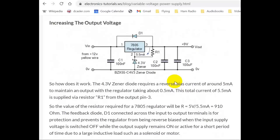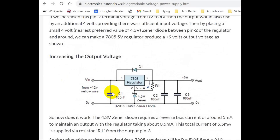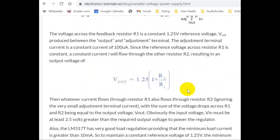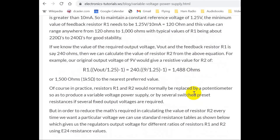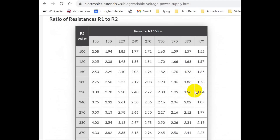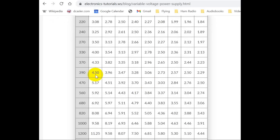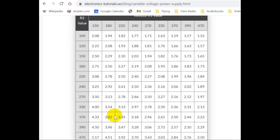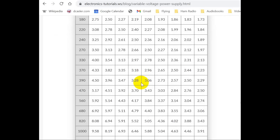Based on some earlier discussions about capacitors, I added capacitors to mine. And then you have this simple formula that you can solve for the resistors. What the site has done that's very nice is this chart — the voltage you get out when you use this value for R1 and this value for R2 are shown in here. I wanted four and a half volts, which you can do with the 390 ohm resistor and 150 ohm resistor.